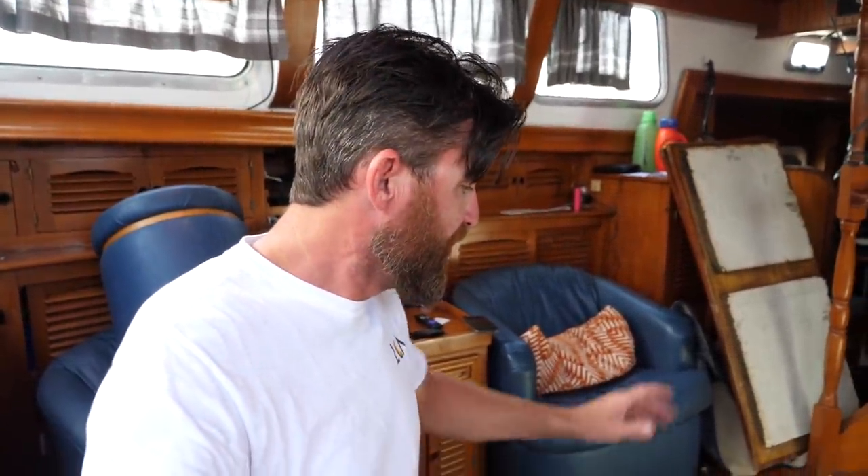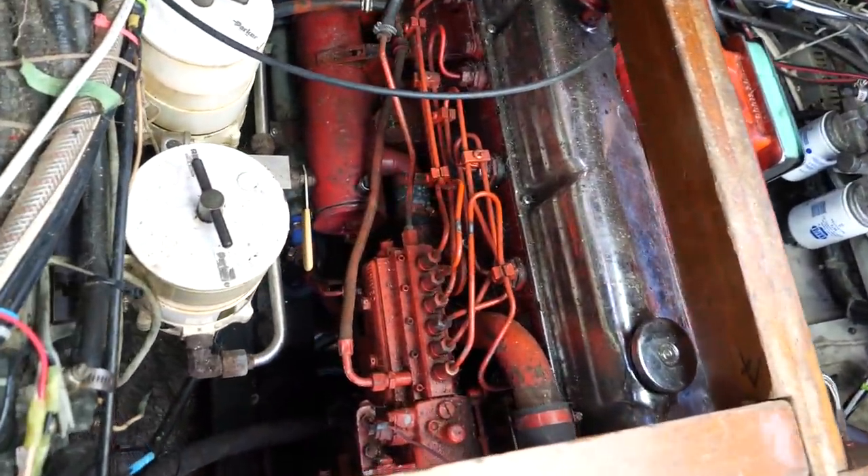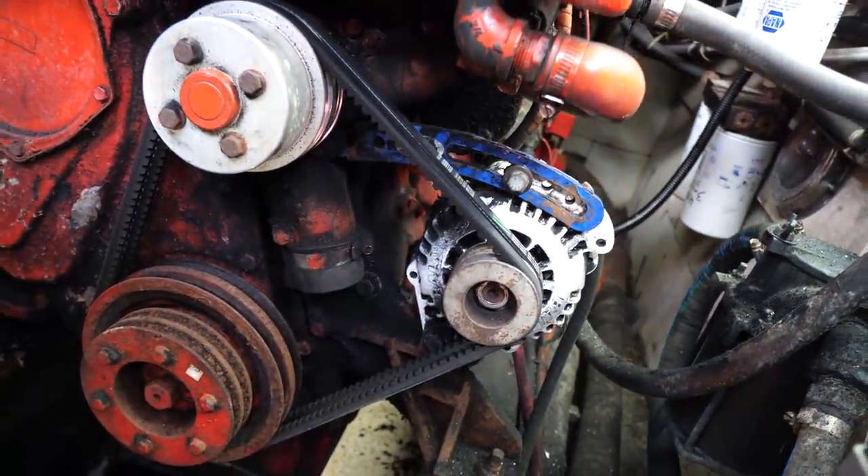For propulsion, wind and solar are great — they're free. When there's no wind or you need to go somewhere specific, we have a diesel motor. It also has an alternator that can charge the batteries, just like your car. This is a Ford Lehman 135-horsepower diesel motor — basically a tractor motor. You run it at about 2,700 RPMs. It has about 4,000 hours on it but should be able to get 20,000 hours total. We can do about seven and a half knots on flat calm seas, generally about six and a half knots in real conditions.